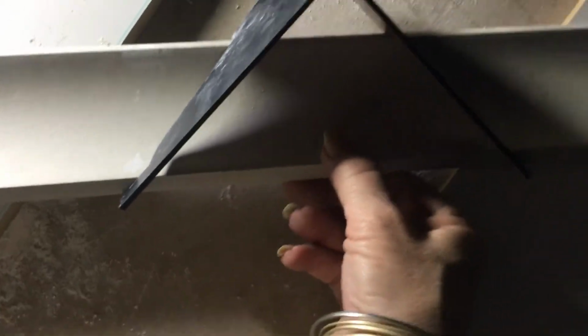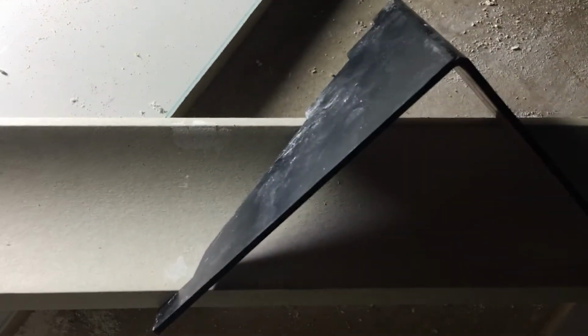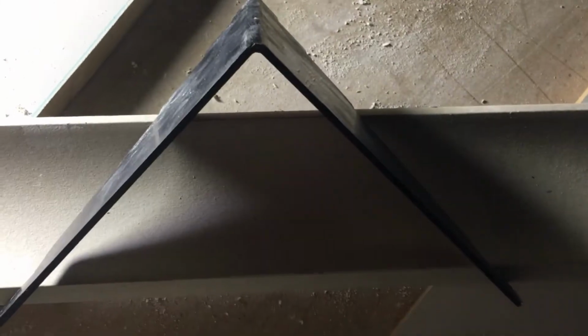When you're cutting the cornice, try and work on a flat surface. What I've done is I've just taken 2 pieces of wood so that I've balanced my cornice in the middle, so that when I cut it, it doesn't just fall off, because then it ruins your angles. So if you can do that, it will help out quite a lot.